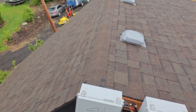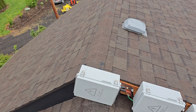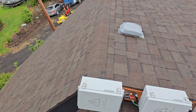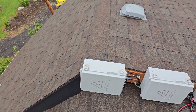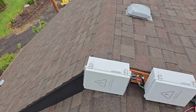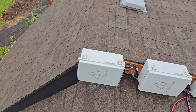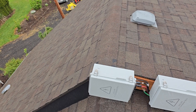The way we're going to wire this: four panels in series brought into this combiner box, then another four panels in series brought into the same combiner box. That gives us eight panels total — two sets of four wired in series — and the combiner box parallels them together.